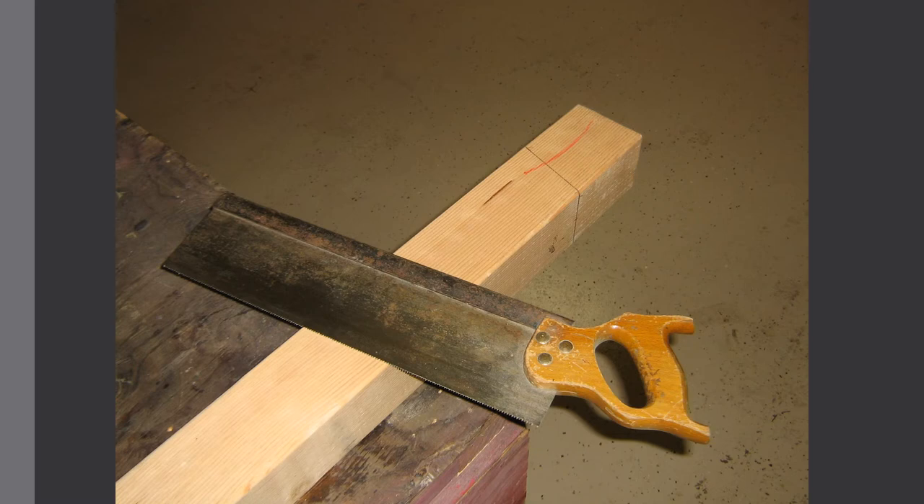Now let me explain how I cut these compound miters — that's what these are. It's multiple angles on the end of a timber, called a compound miter. My father-in-law gifted me some of his dad's tools. This is Grandpa Floyd's back saw — it's still sharp and I truly love to use it. Although it's a bit tarnished with a little rust, I cherish it for its sentimental value. Back saws have a stiffener running along the top down their length that keeps them from flexing, so they're really made for doing precision cuts, which is exactly what we're doing here.